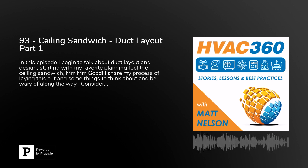Sometimes you get a basement section that's going to be different than the first floor section and the second floor section. So all three floor-to-floors could potentially be different, especially when you have an addition trying to line up to an existing building. Things can get kind of funky because architects will basically play with the numbers to make things work. This is for various reasons, whether it's sight lines, or they want it to look a certain way, or they need certain ADA levels. They can't change the elevation too fast because they need to put a ramp in. So there are various different factors. Again, I think the best place to get this information to start your ceiling sandwich is going to be the architectural sections, because they are thinking through all these different processes.